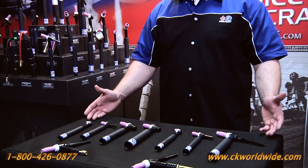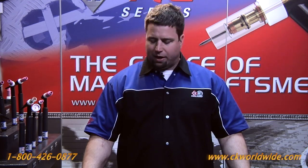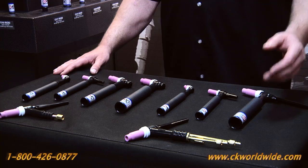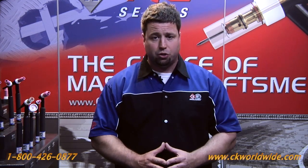Here in front of me I have seven designs, ranging from 80 amps gas-cooled to 350 amps water-cooled. Choosing the right TIG torch for the right TIG welding application has everything to do with productivity. You don't want something bulky, heavy, or possibly water-cooled when you're welding something like 80 thousandths chromoly where all you need is 125 amps and possibly a gas-cooled torch instead. So I'll go through the difference between gas-cooled and water-cooled TIG torches to help you choose the right one.